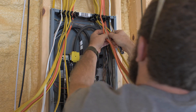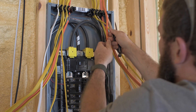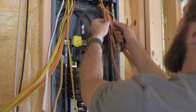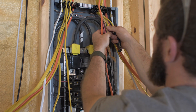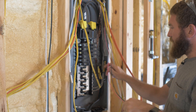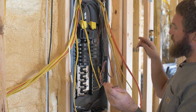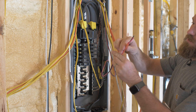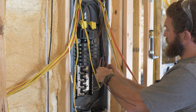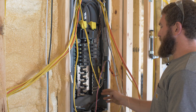I'm going to go ahead and strip this wire all the way back to right after it enters into the panel, take the insulation off and expose the wires, and run our power to our breaker. In this application we've got a red, a black, and a white. Our white is the common, the red and the black are the two hots. Then we've got our copper wire which is going to go to our ground bar right over here. Since the panel is not labeled right now, we're going to mark which wires are what so we know which circuits go to where. I'm going to cut this to length, tie it into our breaker, tie the ground into the ground bar, and the common into the common and we're good to go.